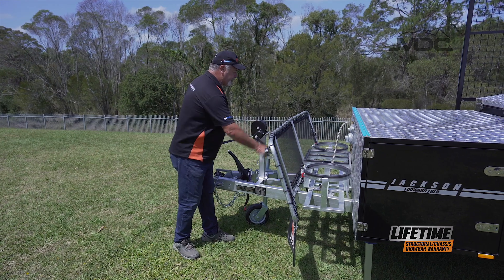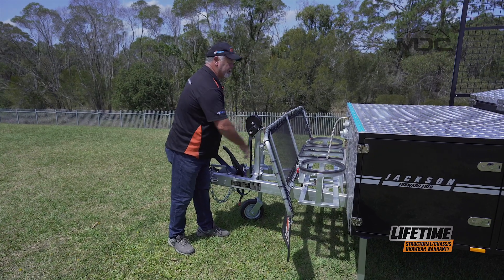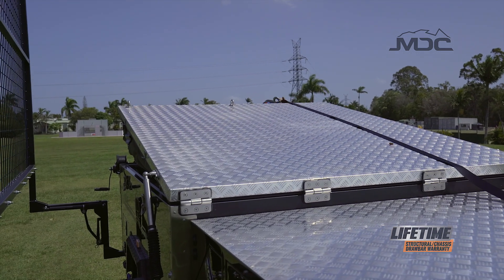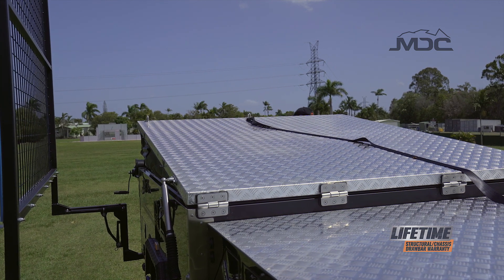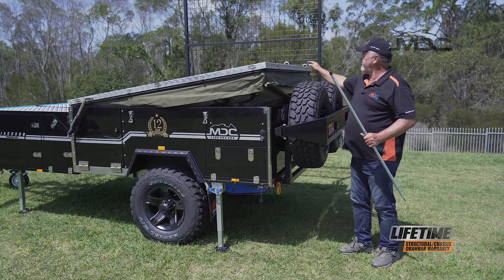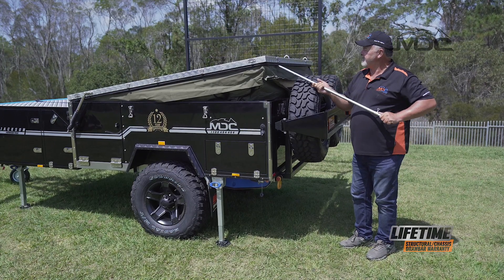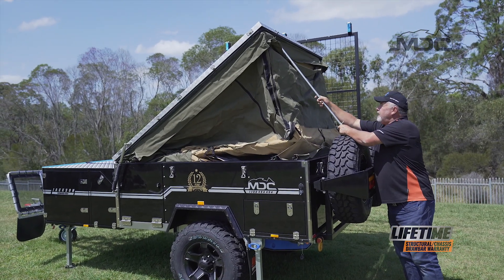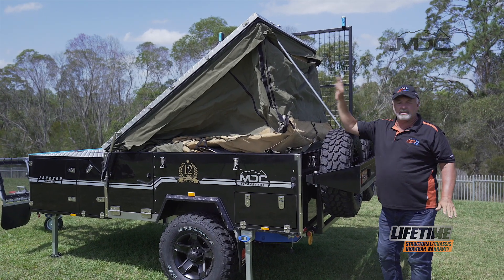Now I'm just going to unwind my front winch, get enough slack in the webbing so I can run it to the middle eyelet on top of the lid. To make winching easier and safer, so I'm not putting a shear load on the hardware on top of the lid, I grab a spreader pole, put it underneath the lid — not against the seal — push the lid up and place it on the tyre. That gives me an excellent angle to winch the top open.